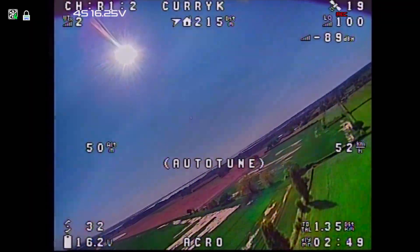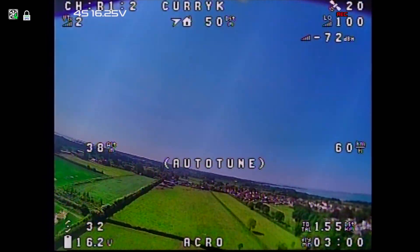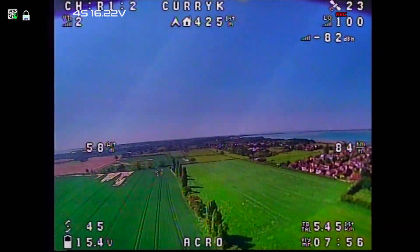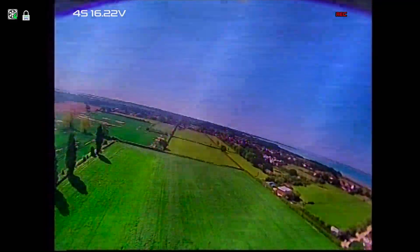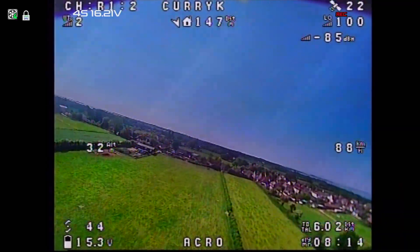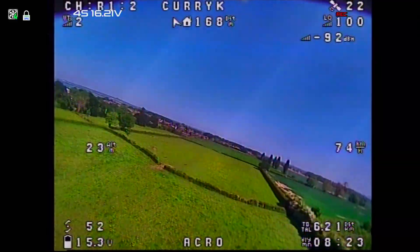One thing I picked up on quite early was some sort of diagonal banding on the video which I don't remember having before. We've got quite a good picture but you really do notice that diagonal banding, and it gets much worse when I increase the throttle. You can see the screen went a bit mental when I powered up fully to launch. Here's me winding up for a full throttle pass and you can see a lot more interference on the screen along with the OSD pretty much disappearing and flickering. Got a fairly respectable 155 km/h, though it was a little wind-assisted. This made me think there's noise coming from this ESC, and perhaps all that bulk in the previous ESC was those capacitors keeping the voltage more regular.